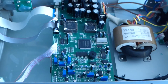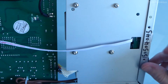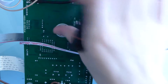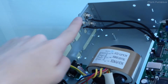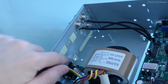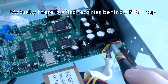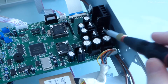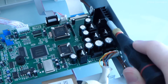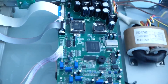The main board here is just suspended in the middle. All of the stickers have actual writing on them rather than just QC pass — there's actually writing on almost all the stickers, which is something I don't see very often. The output of the transformer comes in here, and they've got two rectifiers, which is interesting — they're not discrete diodes, they are actual rectifier packages. They go into some smoothing caps, and there's a total of four or five heatsink devices. This one's probably the five volt regulator, and some of them are possibly for the different core voltages in the FPGA.